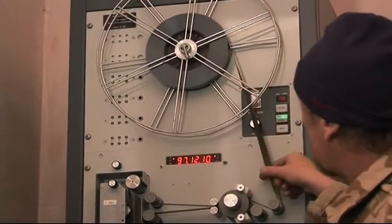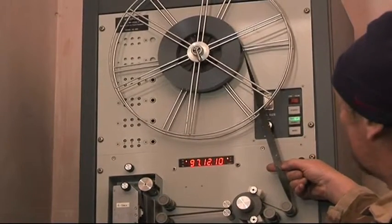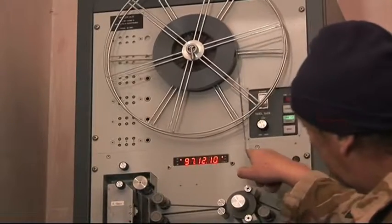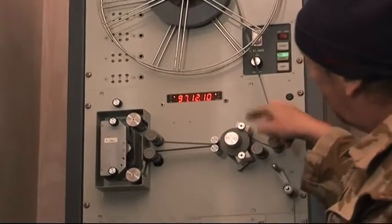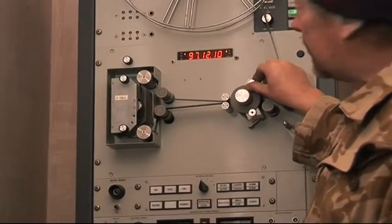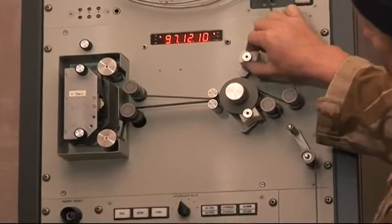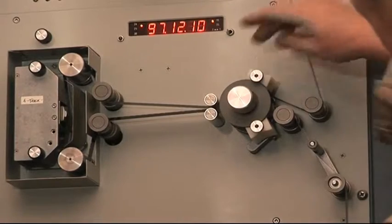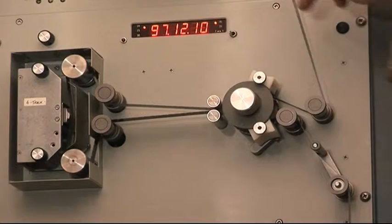Okay, so I've laced up 16mm mag tape, single sprocket, standard 16mm sprocket mag tape. As you can see, tension is working, goes through the sprocketed servo, and I'd like to point out the first detail. First detail is that it's dual 35mm and 16mm by reversing all the guides. The actual rolling guides are dual 16/35.